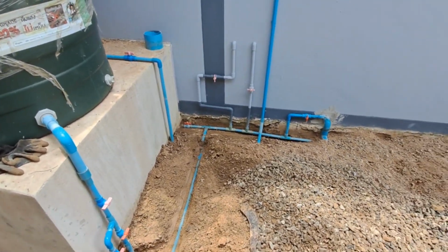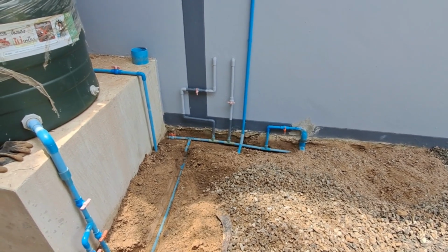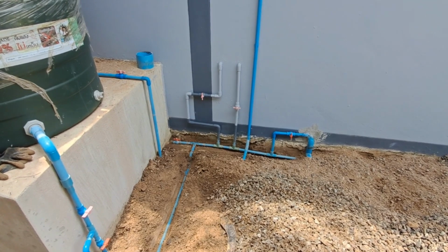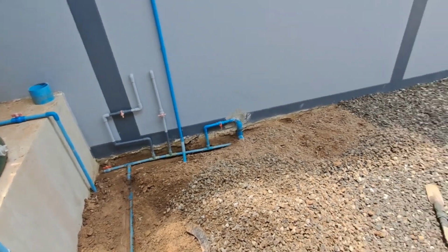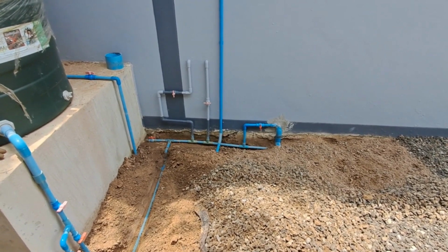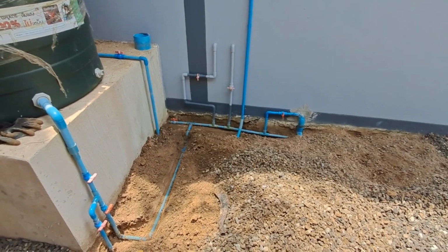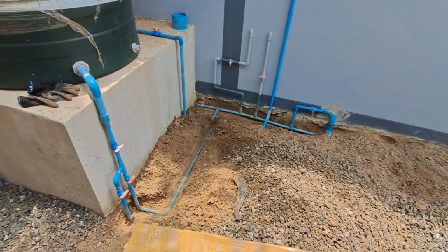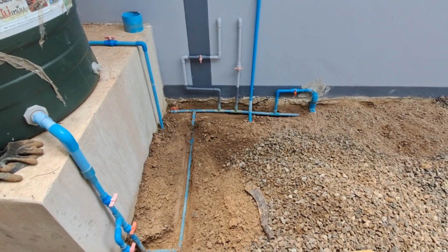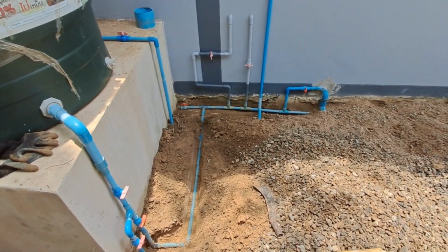So I'm going to replace that valve because I know that it's a weak point, and it could be that it's weeping and then it makes it recycle, and then it gets bunged up with gunk or something for a little while, and then water pressure changes in the pipes because of things being used, and the gunk moves and it starts to cycle again. So we know for a fact that that valve leaks, although it's not leaking at this particular moment and hasn't done so for a couple of hours now. But I'm going to change it because then I'm guaranteed to fix that, and we'll see what happens after that. But I've exposed all the pipe runs just to check where they go, and basically start to let them dry out a little bit, some of them anyway.